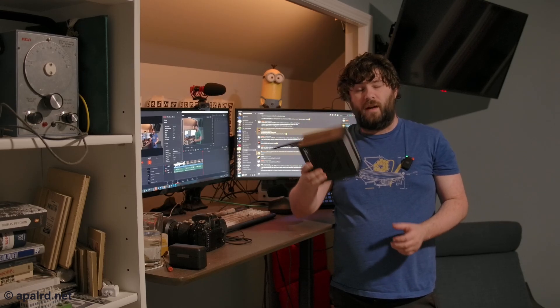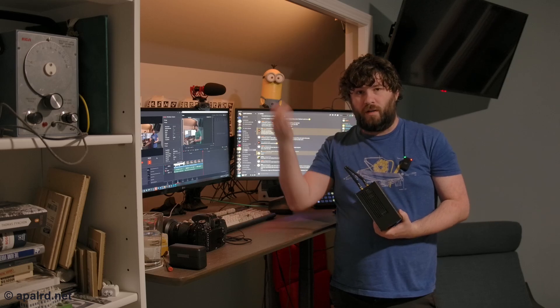As a follow-up: both the WAN port and LAN port are 2.5 gig and they both work at 2.5 gig. The radios are not particularly fast. The chipset is a Qualcomm IPQ5018, which hopefully OpenWRT supports so I can flash it. I set him up as an access point and he works just fine. I don't own any 6GHz devices to test, so I bought an Intel M.2 Wi-Fi card and it worked at 6GHz. So I guess I have Wi-Fi 6E now, but until you get a laptop or phone with 6E, there's not a lot of point in deploying it.